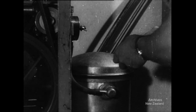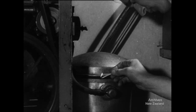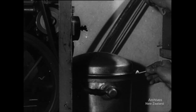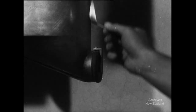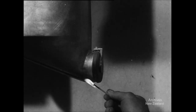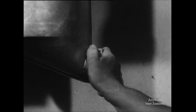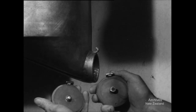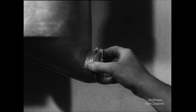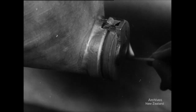Next, the vacuum tank should be tested for leaks with a lighted match. This is a weak spot — it's caused by a perished flap which looks worn and uneven beside the new one. A final test shows all is now well.